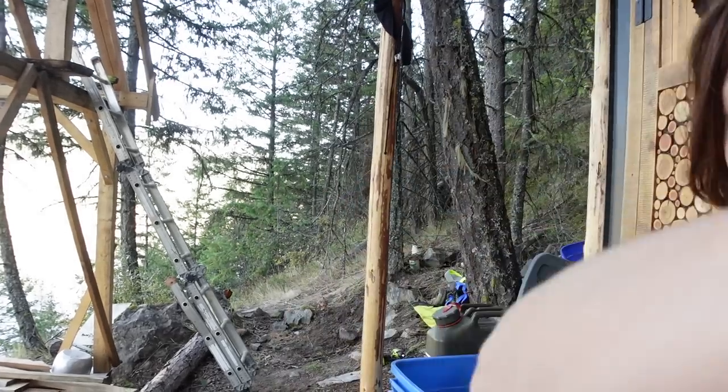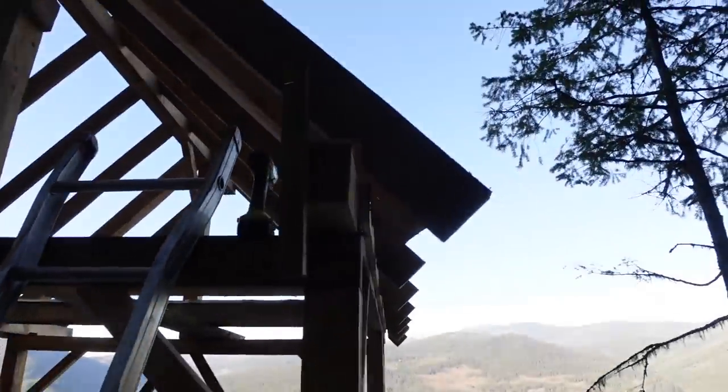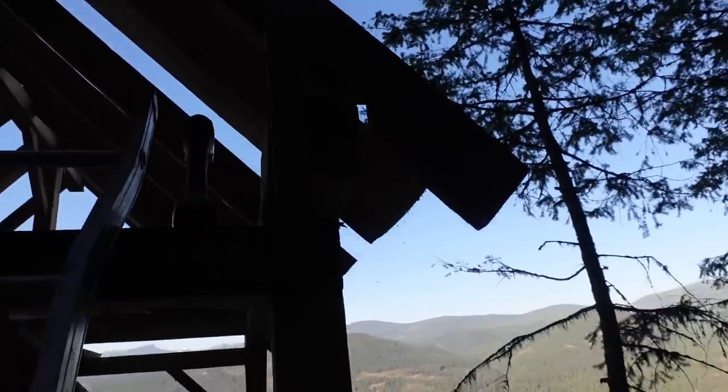Hello. I just ran into a little problem on the far side. So I've just taken a bit of time to try and figure out why it happened, like what's going on and if I can fix it or hide it. Yeah, the rafter on the lower part is quite low, probably that much lower than the big cedar one. And the cedar one is a little bit proud, to be honest. Probably like a quarter inch proud to the next one beside it. So I either put a little wedge, which I've kind of done, like a shim. The rafter did fit really quite well without it.